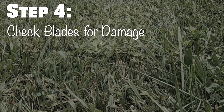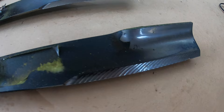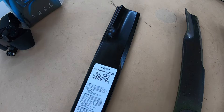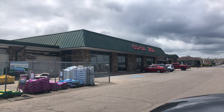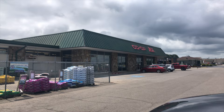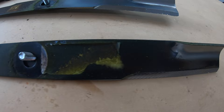The next step is to check your blades for damage. If they are damaged even slightly, it can lead to a bad cut and even result in leaving a strip of uncut grass. As you can tell from this clip, the rock I hit did damage the blades, with one looking much worse than the other. I feel that this was one of the larger factors in causing my uneven cut. For slightly damaged blades you can try to sharpen them, but for more heavily damaged blades you'll want to replace them. I would suggest getting OEM blades or blades that are well known for quality. The Amazon blades I purchased didn't even last a month. For the new set, I went to my local lawn care shop where I purchased my mower, as they had the OEM blades in stock. After the first couple mows, I could tell a huge difference compared to the Amazon blades.